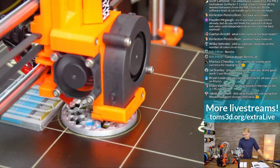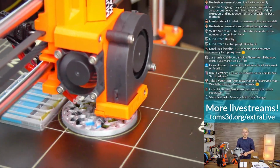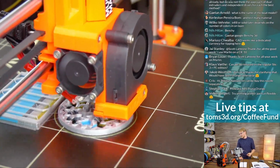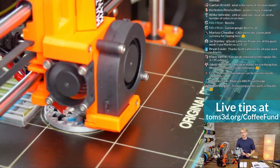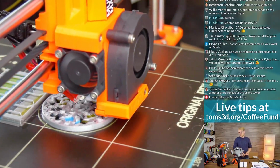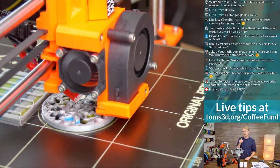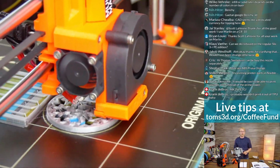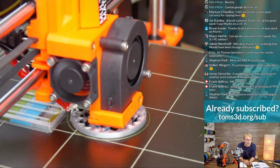because it's going to work fine most of the time, but you're going to have that moment where everything falls apart, where it cracks or starts melting or deforming, and then you're not going to have a 3D printer to reprint those parts, and you're going to be screwed. So PETG for 3D printer parts, very much recommended. Anything that is a bit better, on par with PETG as far as thermals and mechanical properties go, is perfectly fine. But pretty much that. PETG, again, perfectly fine if that's what you want to use.